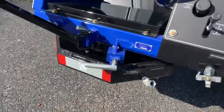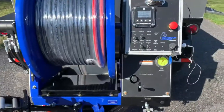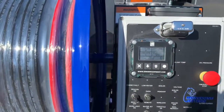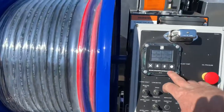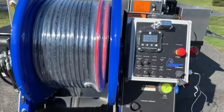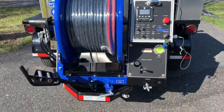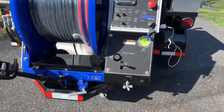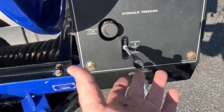At the bottom you've got your return-to-antifreeze tank and a three-way recirculation valve, so you can recirculate anytime you want. This jetter can be controlled right here at the control center. You can see the digital panel — with the key on, it shows your water pressure, engine hours, and engine RPM. You can throttle up and down with the arrows, or switch it to pressure sensor mode and hit pressure up to step through 1,000, 2,000, 3,000, and 4,000 PSI without trying to manually balance the throttle.